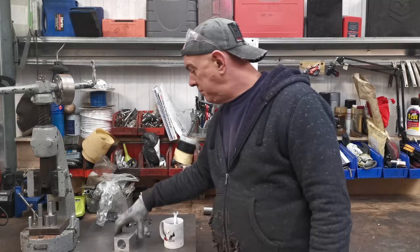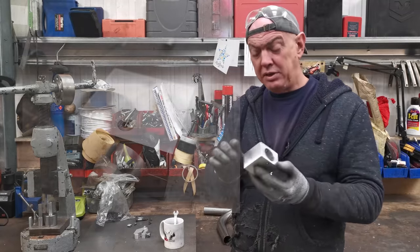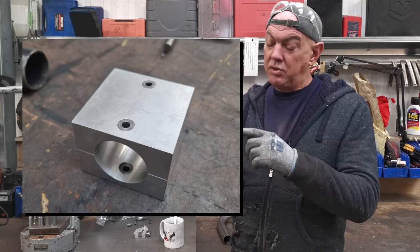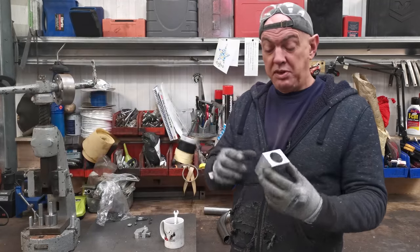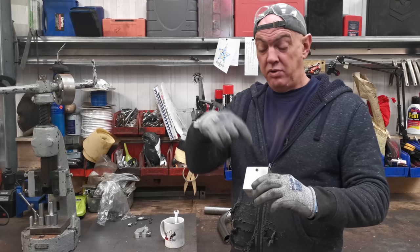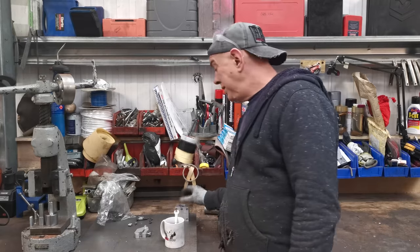I also did my steel inserts. I'll get a picky of this stuff and show it to you. But these are just the drill guides, so top and bottom, exactly opposite one another. I can just use that in the mill for a drill through, and I'm not going to trash my jig. So that's all good.